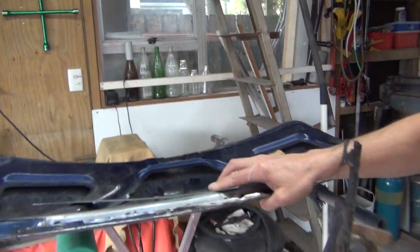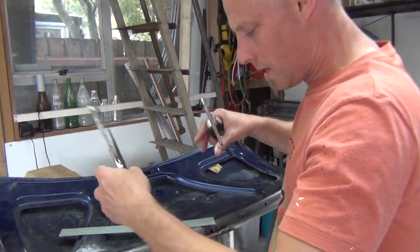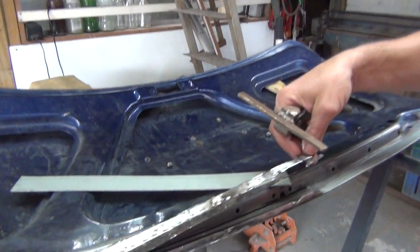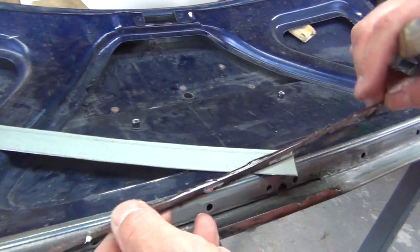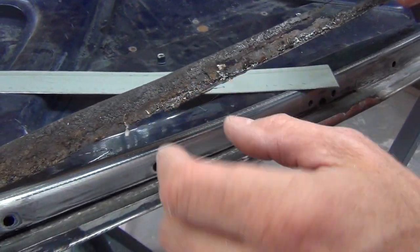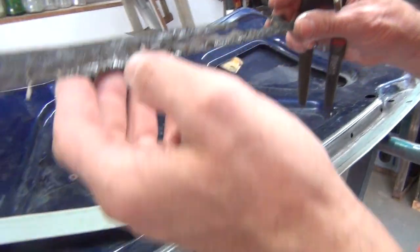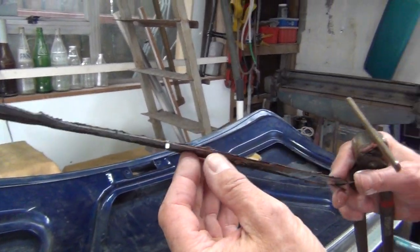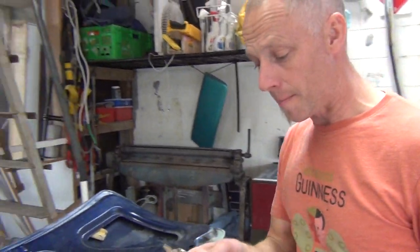The rest of this doesn't seem too rusty, but the inside frame was a problem — tucked under the skin or the edge of that skin. I went to braze it and it just all blew out at me. I couldn't really fill those rust holes with silicon bronze. It's got a whole lot of really bad rust and some kind of thick gooey rust kill or rust sealer. So that's no good to me — I had to cut it out.